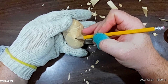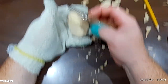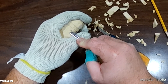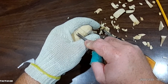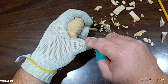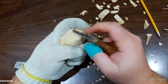I'll make some marks — these will go up the center of the nose. I'll just mark out the sides of the nose. I have this number 8 Drake palm gouge I like to use for this. I'll come in next to the nose and push a groove over to the side of the head, making it about one and a half of these wide to start with. Then I'll go back in and make it deeper right next to the nose.